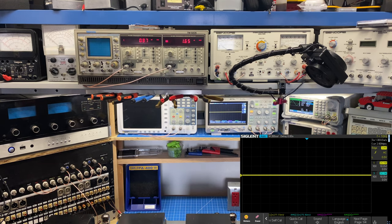And we'll see this sweep through a range to give us these measurements. So first off, I have to set this up. The spec sheet gives frequency response specs at full rated power and also at a half watt. I'm less concerned about the frequency response at rated power because you're not going to be listening that loud. It's more just for the spikes and stuff in different parts of the music. You're going to be listening probably around a couple watts on this thing.